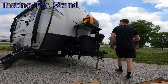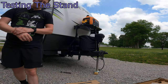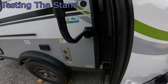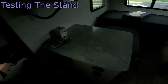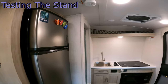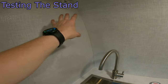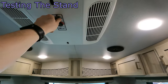You might want to get an electric start especially if you have bad shoulders, you're older, or maybe you're shorter. I've got economy mode on, setting it to run. Making sure my exhaust — okay, exhaust is blowing out the back. You really don't want your generator exhaust blowing towards it because you might end up burning your paint. Going hands-free — yeah, very quiet right now in economy mode. I'm going to bring it inside and see if we can even hear it inside or not.